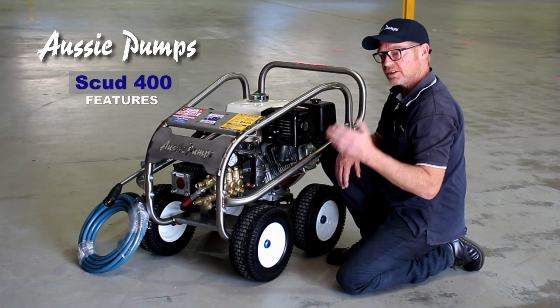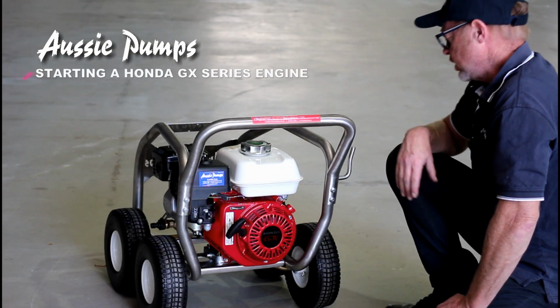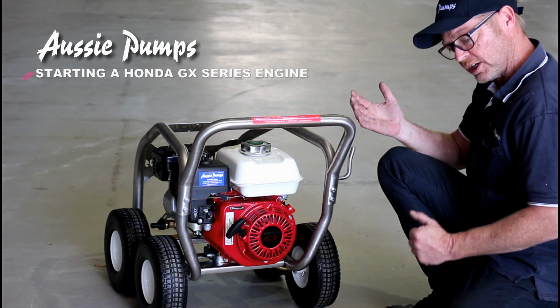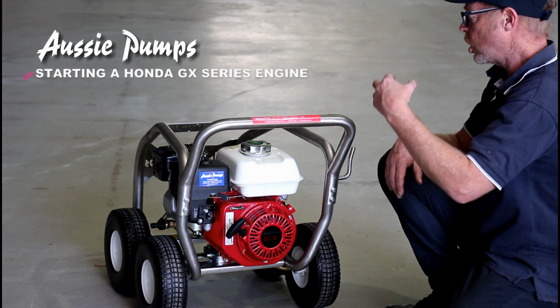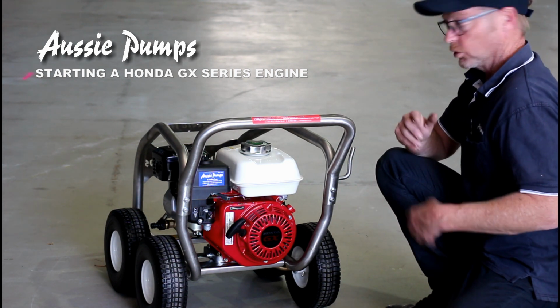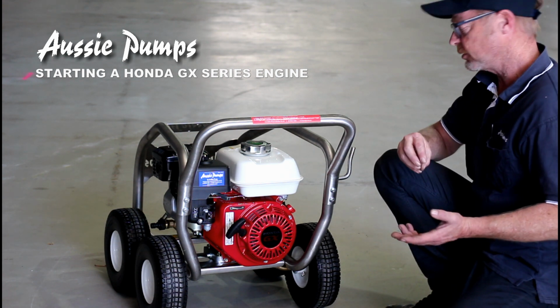What we don't want to do is start our machine without water in the pump. Now to start the Honda engine, it's very simple. Once you have your hoses hooked up and your water turned on, please ensure that you pull the trigger of your gun and have water coming out of the gun, so you know that the hose, the whole line and the trigger assembly is full of water ready to run before you start the pump, or before you start the engine. That means you're never going to run your pump dry if you follow that sequence every time you use your machine.